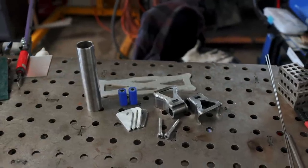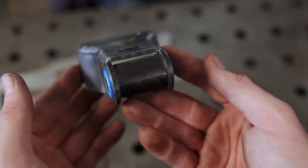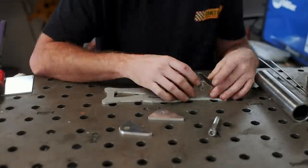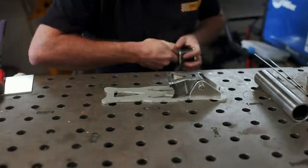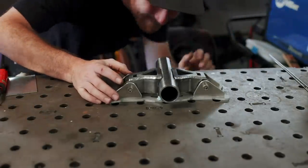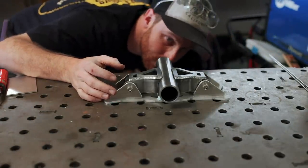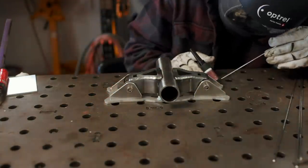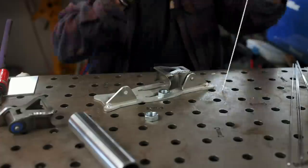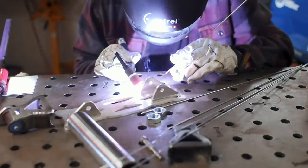With the bushings finished up, we have all of the parts and pieces we need to start building this mount. First on the list is to install these bushings into their housings — they pressed in nice and snug, and will allow us to locate the rest of the parts for this assembly. Everything looks pretty good, so we need to tack it together, disassemble it, and weld it up. The pressure is on for this one, because these will definitely be my most visible aluminum welds on the project so far. So I gave things a little extra time and gave the part that once-over extra cleaning to try to get these welds to turn out at least halfway decent.